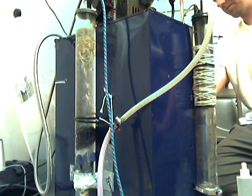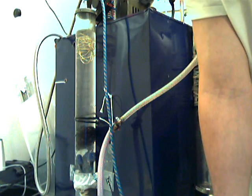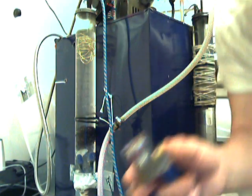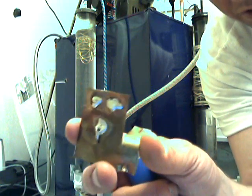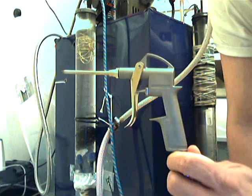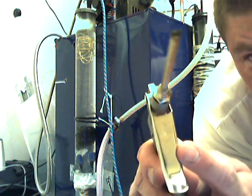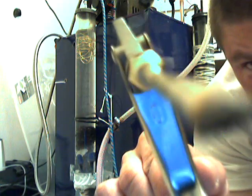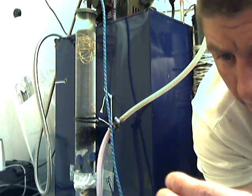The gas scrubber is definitely helping out on the solder a lot. A gal suggested the gas would scrub better if I made the bubbles smaller, and it definitely works. These splotches of solder you see are directly over the area I was heating - in the past I was unable to do that due to residue and buildup from the flame. The torch cost two dollars at Harbor Freight, the hose cost six bucks. The tip is basically full of bronze wool, and I got some wire packing in there to fill the void. I crimped the tip around a needle with pliers, pulled the needle out, and gave it a final squeeze to get the orifice size right.